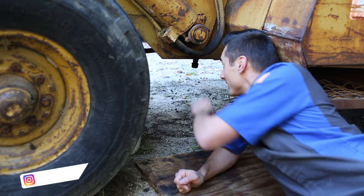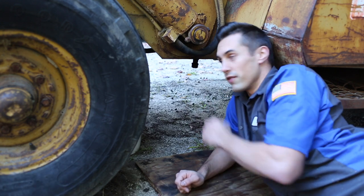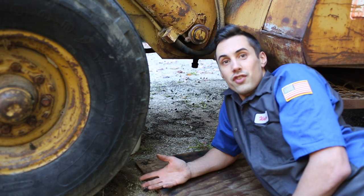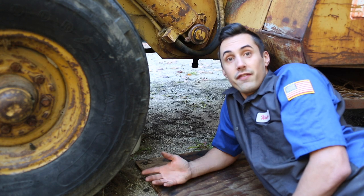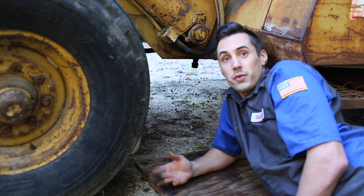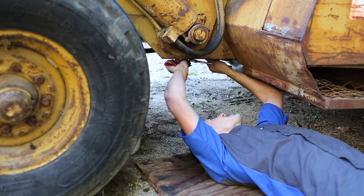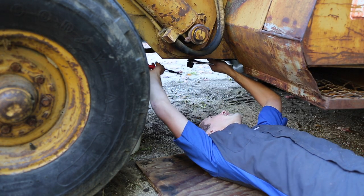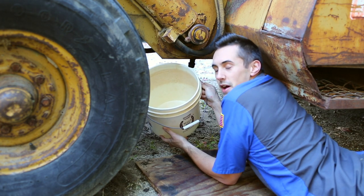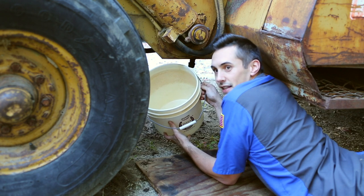The hydraulic fluid drains out of this hose right here — there's just a threaded end cap that screws off. The hydraulic reservoir has a capacity of 26 gallons, though it's not completely full. The total hydraulic system capacity is 48 gallons, so fluid might drain from parts of the system other than the reservoir itself. I have six buckets ready. I'm starting with a small white bucket so I can see any contaminated fluid or nasty sediment at the bottom.